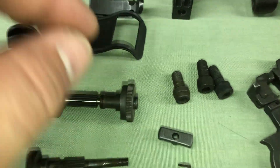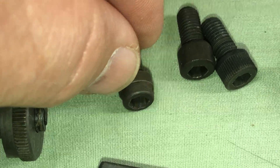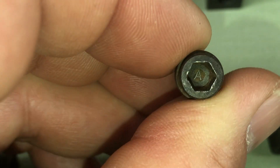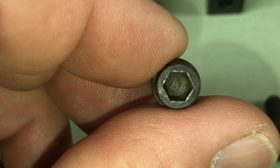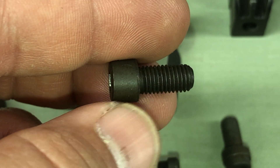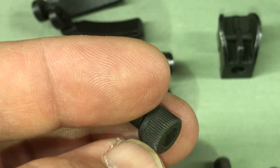The earlier front sight screw has a bevel to it because a seal went on top of it to cover it. Inside is where you can find markings - this one's marked with an A, sometimes used for Winchester, but they were probably used on Springfields too. That's the early version. Then they went to the next one which is smooth sides - no seal on them. Does it have a mark on the inside, yes or no? Some late replacement stuff had knurls to it.